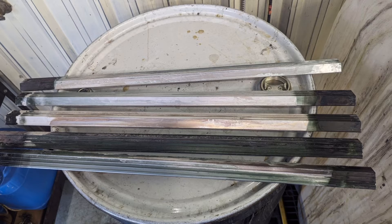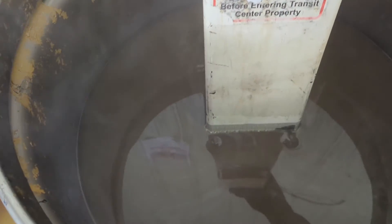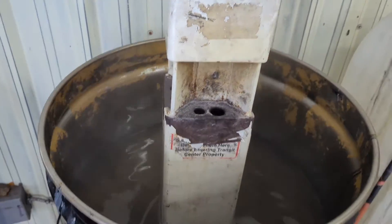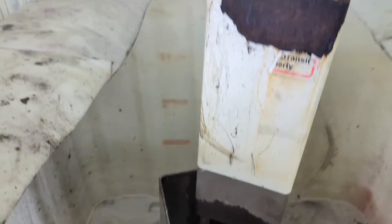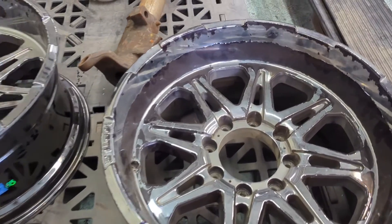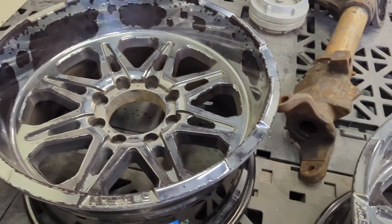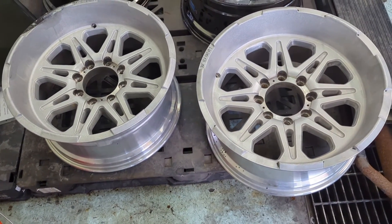I put the piece that hadn't stripped back in and it did eventually strip, so if you run into that problem just leave it in a bit longer. We also threw in an ashtray from a bus stop — one of those fireproof setups — which had a super thick coating on it, and this stripped it off real fast. We also tried PVD coating, the kind of chrome coating you see on wheels — a lot of black chrome — and this strips that as well. You can see these two bare wheels.